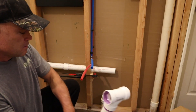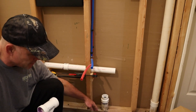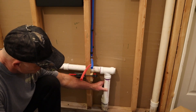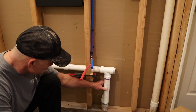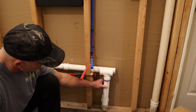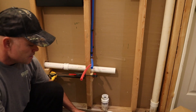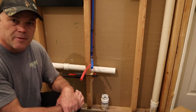So now I'm at the point where I want to connect right here. This is where the water will go down into the pipe that's under the concrete out to the septic tank. So I want to get this measurement correct. I cut me a piece that was slightly over large, and then I'm going to put it in here and measure it and see how much more I have to cut off, which looks like about a quarter of an inch maybe. So I want to put this up here where I think it should be - right in the middle of that pipe - and see how much I have to cut off on this other end. I want to go cut that off and I'll be able to glue that in and this pipe will fit in there. Let me go cut that pipe real quick.